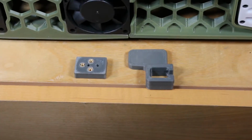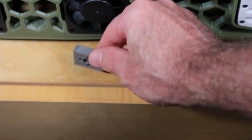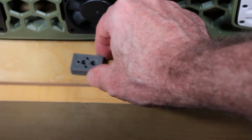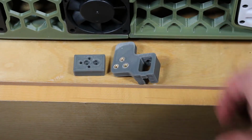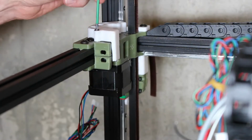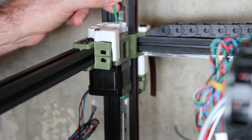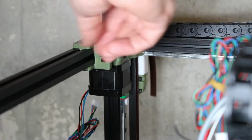The Z-axis parts are really designed for a 2-bolt cable guide, so I had to go off and there's another repo where you can print these that are actually designed for a 3-bolt pattern and adapt to the 2-bolt pattern. The link is included in the description of this video. If, like me, you've attached this cable guide on the AB drive, you'll need to take it off for this next part to make it easier to attach the parts.